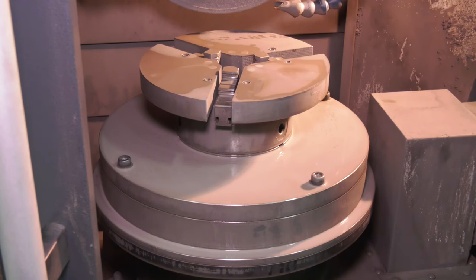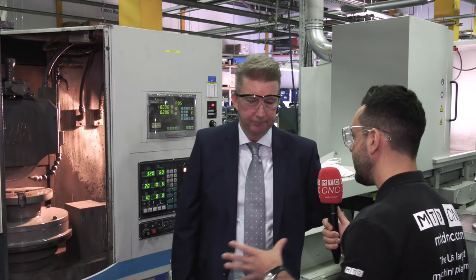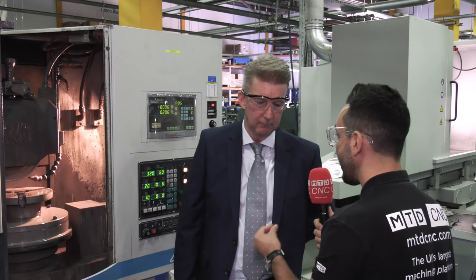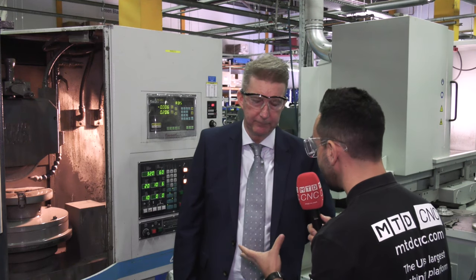When they put the segments on to start with, they finish grinding them to suit the component. Then the component is introduced, sits flush, then it clamps on the inside and they finish machining. We're going to talk to Martin later in regards to the accuracy that they've had to achieve and the process development to manufacture these ceramic rings.